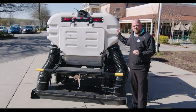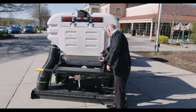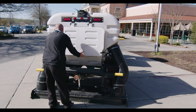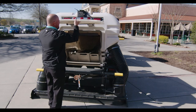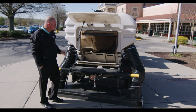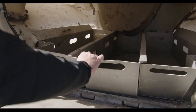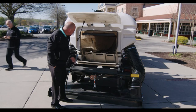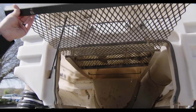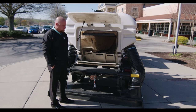As we move back to the rear of the unit, I'm going to show you the inside of the hopper by loosening these clamps. You have a prop rod here so the door doesn't come down on you. Another important feature is our 3-piece bend system, which helps make getting debris out easier on this sweeper. As you can see, there's a screen here that needs to be cleaned out daily. It's driven by the 20-inch 6-blade paddle fan.